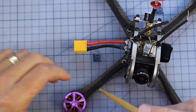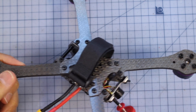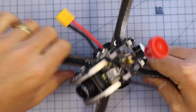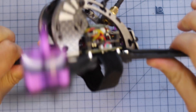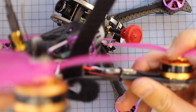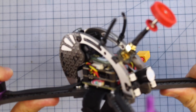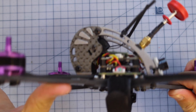Starting at the outside in — this is where it's not really labelled. If we look at the frame, it's a 5-inch racer, 215mm from motor to motor. I just want you to have a look at the carbon — I've seen a lot of carbon in my days and I've never seen a quad that looks like this. In terms of the flex, usually when carbon looks different it's definitely not as strong, but giving this thing a flex, it's not really flexing that much. I'll put a comparison on screen — this is the F200 and look at that flex. This one has way more flex versus the Fury B 215. So this one feels much sturdier, but I'm not 100% sure what sort of carbon that is.